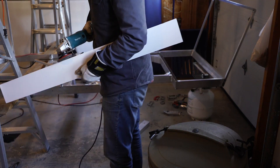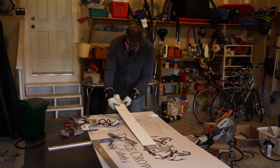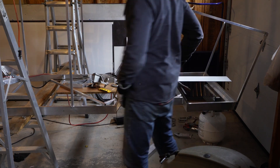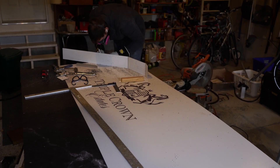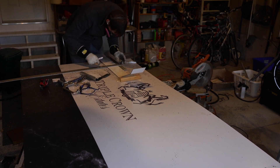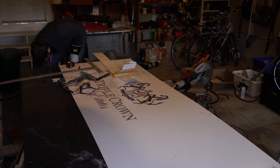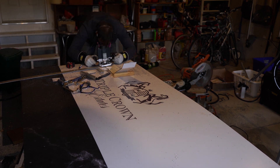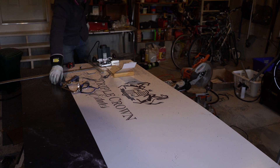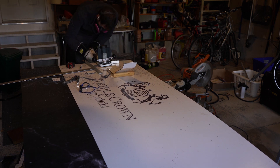I've kind of figured out the process of how to line up the cuts, and I'm just going to fit this by hand. Because as I said, the aluminum does kind of stretch and pull a bit — I don't want to rely just on my SketchUp model anymore. At this point I'm pretty much going manual. The easiest way: just rest the tip of the bit right on your mark and then level your guide. I've got my piece of three-quarter inch square tubing and my angle finder set to 90 degrees, and I get my parallel line that way.